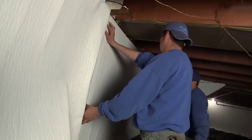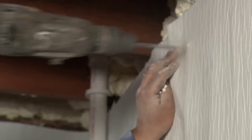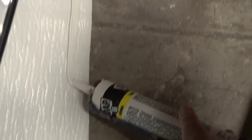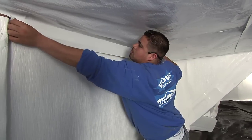A second type of liner is also installed over the walls and floor. On top of that, we're also going to be putting in our product called Zero Perm Liner, which is a 60-mil thick foil-backed — essentially a thick vapor barrier as well. Now the liner obviously comes in rolls. You overlap it and actually affix them together? Yes. Whenever we have seams, the seams are actually overlapped, they get caulked, and then they also get sealed using a four-inch sealant tape.